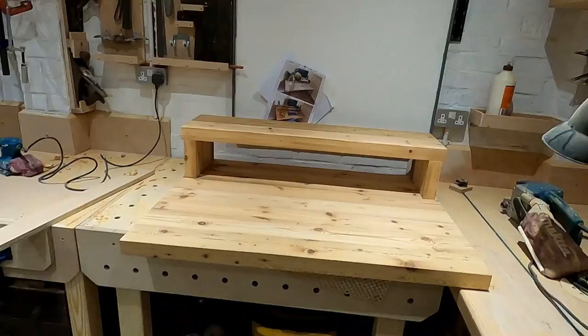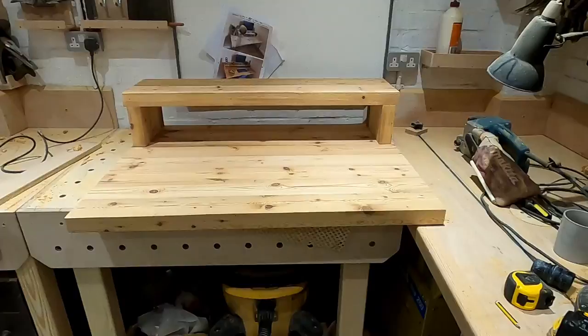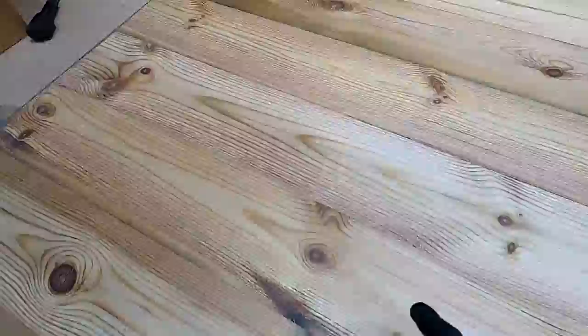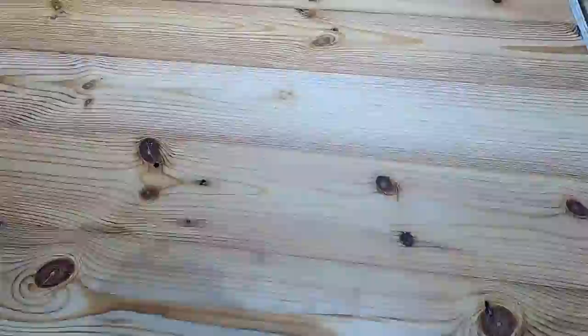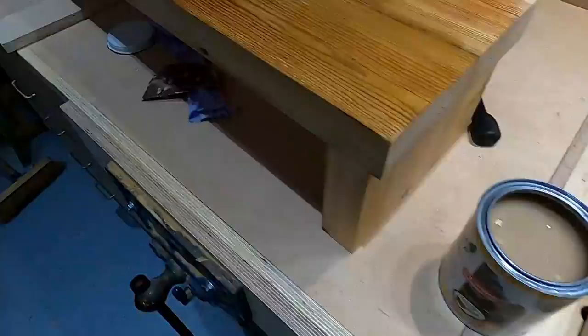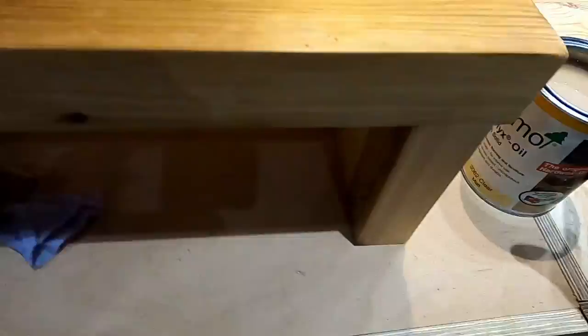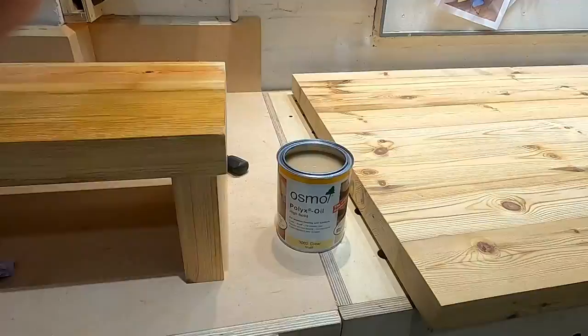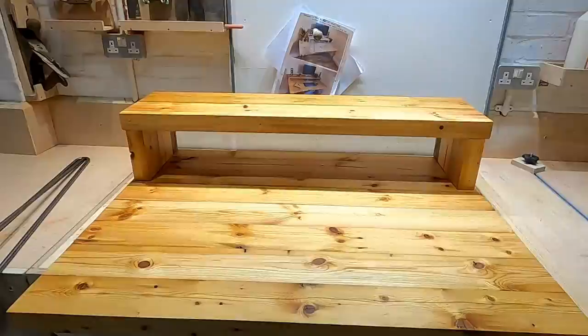I've given it a final sand and glued up the little legs for the monitor support, so it's pretty much all ready to be waxed up now. It's ready for its first coat of wax. As you can see in the video, I've left some nail holes — a few little nail holes and marks. I just don't want to fill everything and get it perfect because it'll just look neat. I want it to still look like it's reclaimed, but still be smooth and practical and usable. So I'm going to start waxing it using the Osmo wax, just a clear matte finish — just going to apply it, let it dry and then buff it off in a couple of minutes.